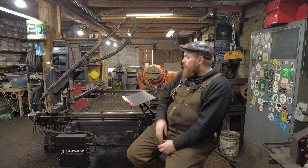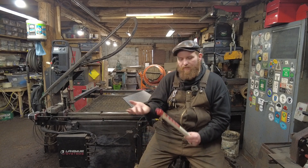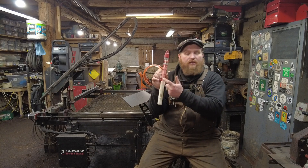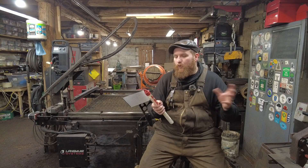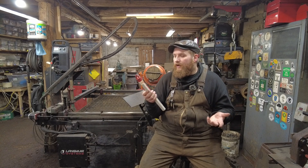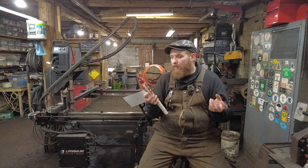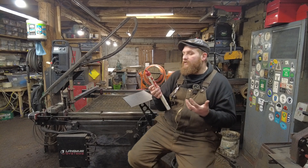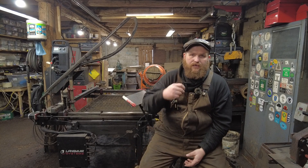So that's what we did. The braze rod I was using is this flux-coated brazing rod by Lincoln Electric — hashtag not a sponsor. There will be an affiliate link in the description if you decide to try this process yourself. These are a welding position of horizontal and vertical, one-pound tube, eighth-inch, flux-coated bronze. It's a general purpose copper-based brazing alloy rod used extensively for gas brazing steel, other copper alloys, cast iron, nickel alloys, and stainless steel. No additional flux is required. Preheating is recommended in some applications — most likely for cast iron, where you have to preheat before brazing to avoid creating more cracks.